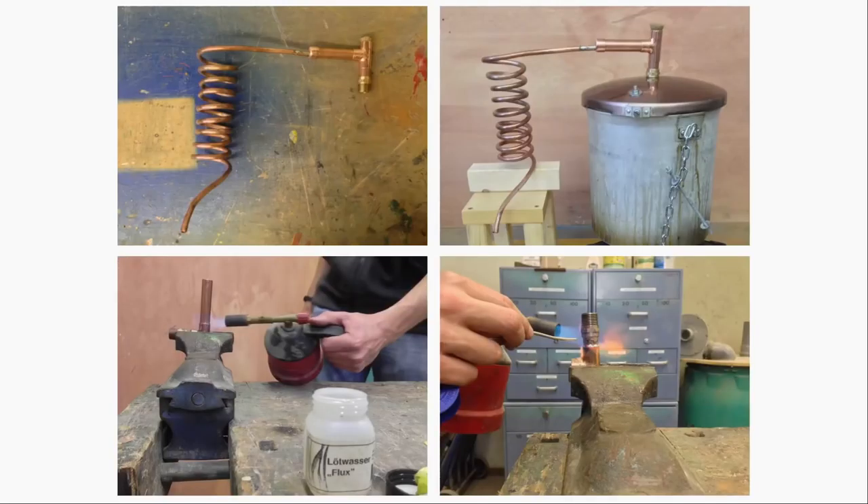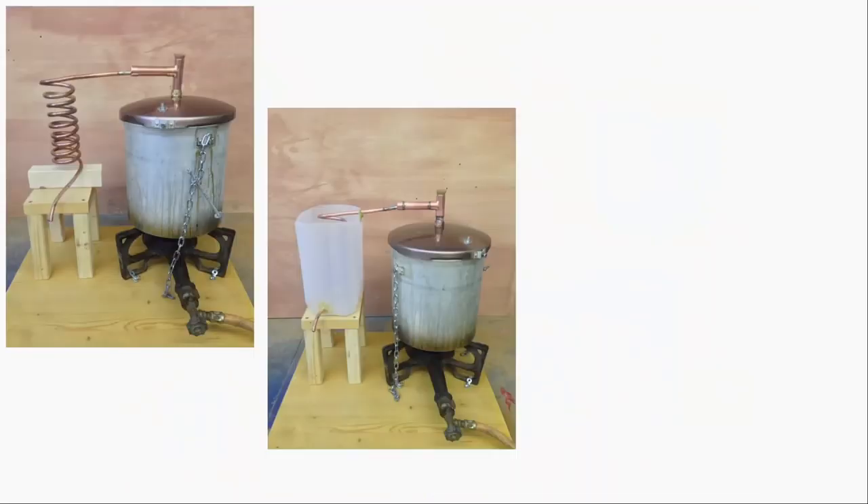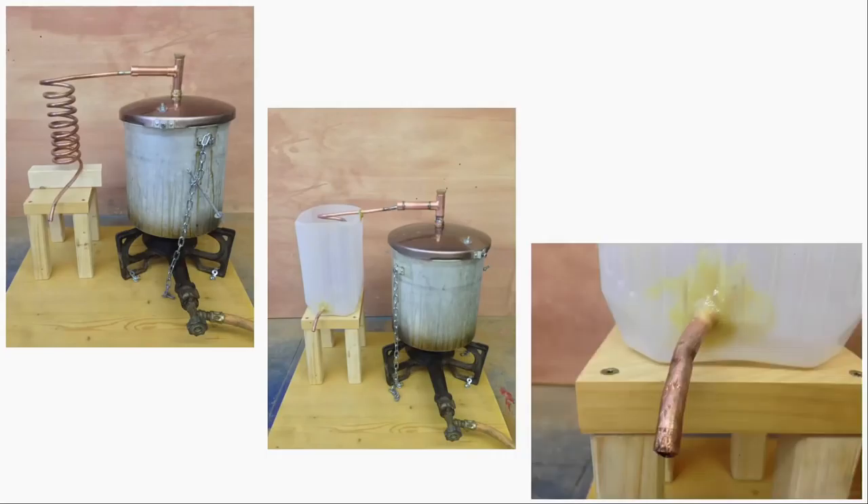Then you need to do some soldering. This is another kind of soldering — you use tin, copper, and some flux to make it flow easier. Not a soldering iron but a blowtorch, but that is all the difference there is. Then you drill a hole into your cut-open canister, push it on there, and use lots of glue to make it waterproof. It is no rocket science.